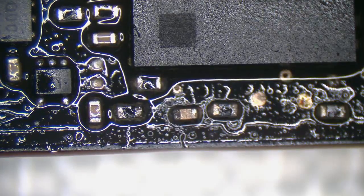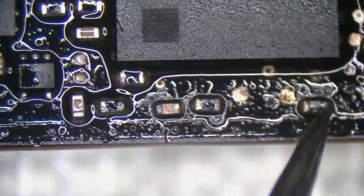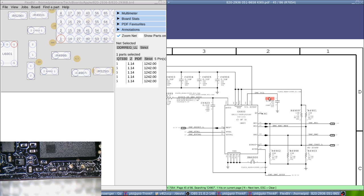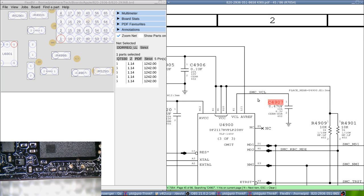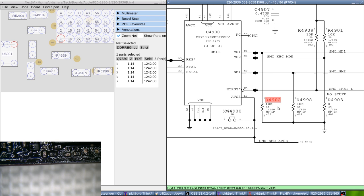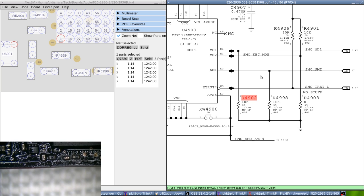This cap — let's see what that is. SMC VCL. Not exactly sure what VCL is. And this resistor — you're a pull-down on SMC MD1, that's a mode selector, and you should be 10K. I'm just going to test that. We're getting 9.9, so that's acceptable. It may be an SMC issue yet. I forgot to check my voltage on that. Let's see if we're running at 1256 — no. Pretty sure that cap's a goner, so we'll get that replaced. Pads seem okay. That cap did get knocked off pretty easy. It is dedicated on its own, so changing my mind on that.